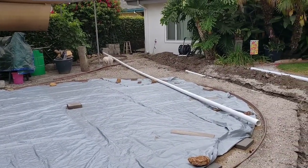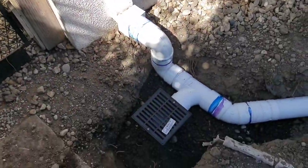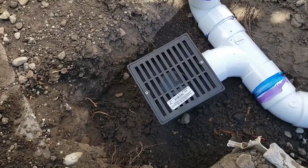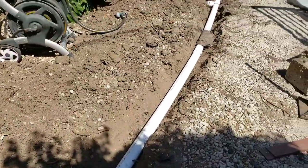After a good part of the day, I did more than just rough it in — I actually glued it all up. I'm definitely not a plumber; I've never plumbed irrigation before, maybe drippers, that's about it. Let me show you what I ended up with, going from top to bottom. Right here we've got the downspout going into the three-inch pipe, and I also added a surface-mounted grate that screws on so I can remove the top and flush it out if needed.